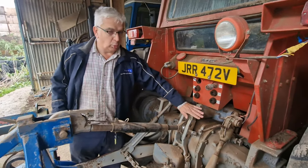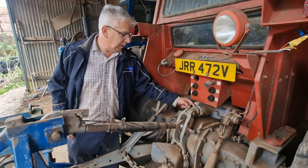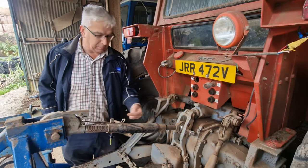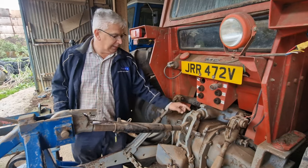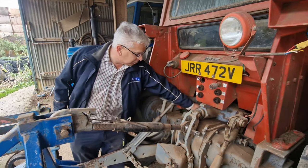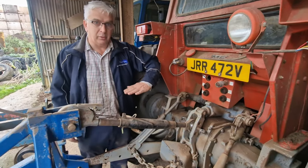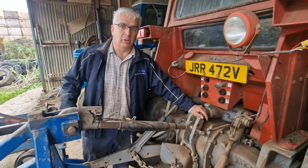What we've got here is what we call upper link sensing - top link sensing. If you look in here, there's a piston which is actually sensing how hard this is pulling backwards. So when it dives in the ground and really gives a hard pull, it senses that. That's then linked through here to your rocker arm - these two pieces here - which then works out whether it needs to lift or lower. It's quite simple, though there's a bit more to it than that.